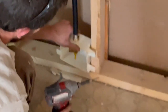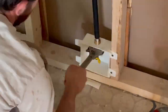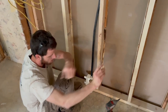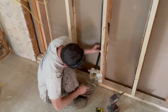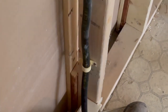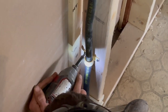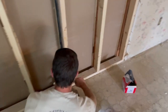For this gas pipe — if it's half-inch pipe, use a three-quarter flat strap because it's thicker on the outside. Make sure you strap it coming down the wall. I'll put a screw through it. It's tough to get this thing perfectly straight, but it's going to stay in the box.